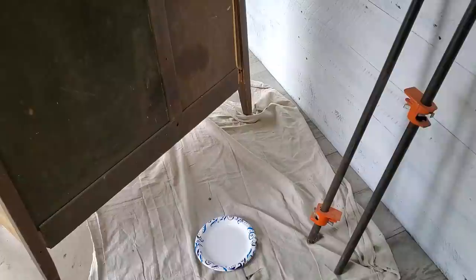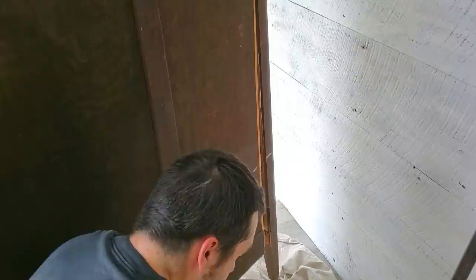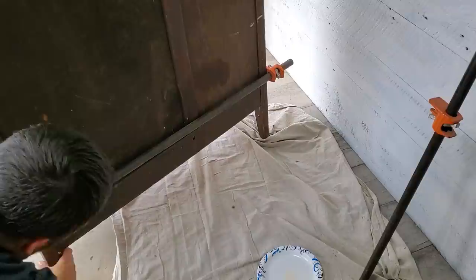Now, the first thing I do is I'm going to shore everything up. I'm going to try to glue the corners together, glue any of the moving pieces together. You just got to shake it around and see where it's moving. A lot of times, on these back panels, you'll have some shifting and some moving. So that's basically what I started out doing, gluing everything together, using the syringe and getting deep into these channels and gluing everything together.